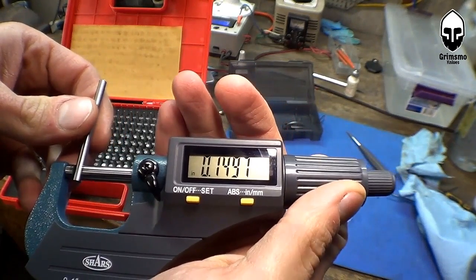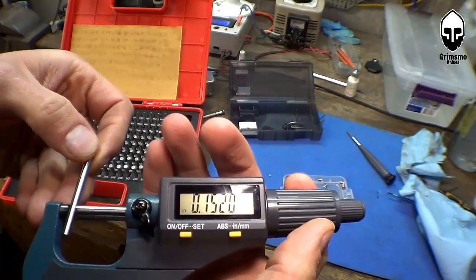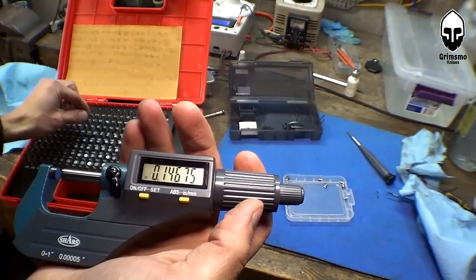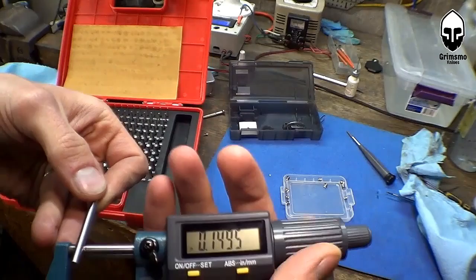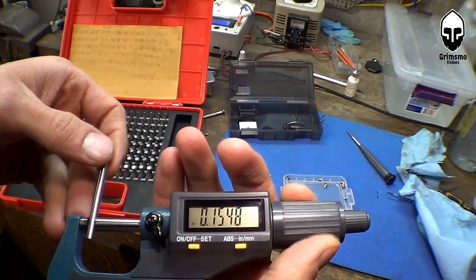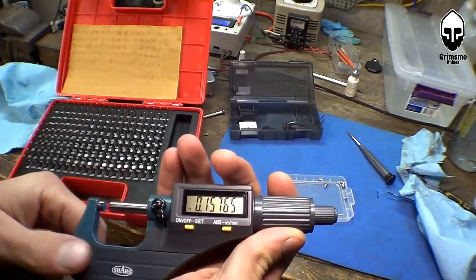The gauge pins go from 1/16 inch to 1-1/4 inch, and they're all plus 0 or minus 2 tenths accuracy — they would either read 250 or 249.8 or something like that. It's a complete range in 1 thou increments. I'll take a 150 for easy measurement. It reads 3 tenths under. I measured them all yesterday and they were 2 tenths under. So maybe this is off by 1 tenth right now, which doesn't really concern me. They're all basically 2 tenths under, which is within tolerance, and it proves the micrometer accuracy is within 1 tenth of where it's supposed to be.